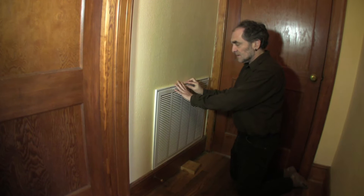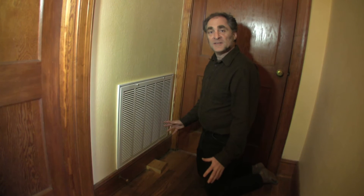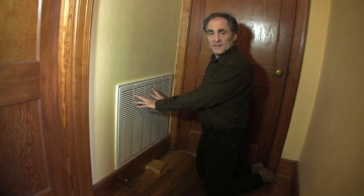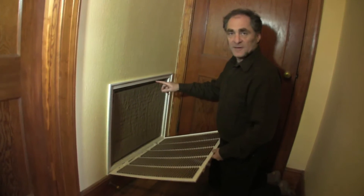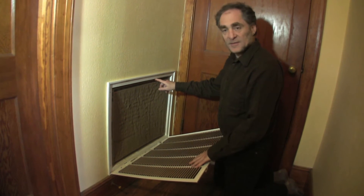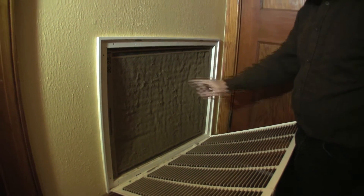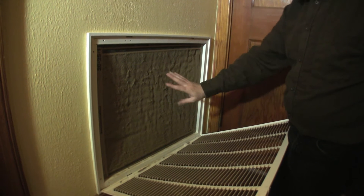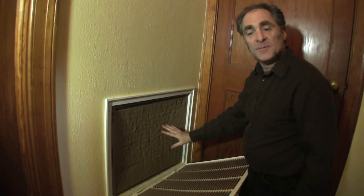It's very important that your return is big enough, because any furnace is designed to put out an equal amount of air that it's pulling in. If it can't pull air in through the return, it's going to pull it from somewhere else — probably where the unit is, down in your basement or up in your attic. In both those cases it'll be much colder air, which takes much more energy to heat. Now opening this up — here's the filter right behind the return grill. Look at how it's bowed in; the furnace is on right now, pulling that way. This filter is dirty enough that it's creating a bit of a vacuum — the air is having a hard time getting through.